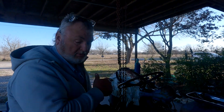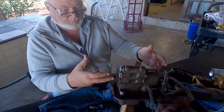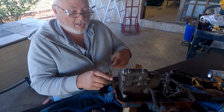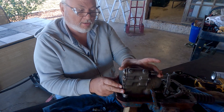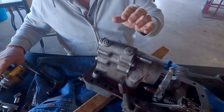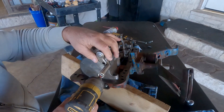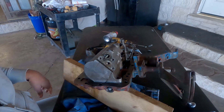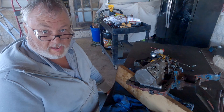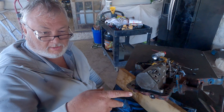Let's talk about the unloader valve — that's the big issue. This is the top lid assembly I pulled completely off. There's a piston with an o-ring and a leather seal, and some o-rings on the base. I spent a week trying to figure out what was wrong, then I happened to read a forum that talked about an unloader valve — and that was exactly the problem. I'm hoping this helps anyone with a Ford 600, 800, 400, or any of the related models.